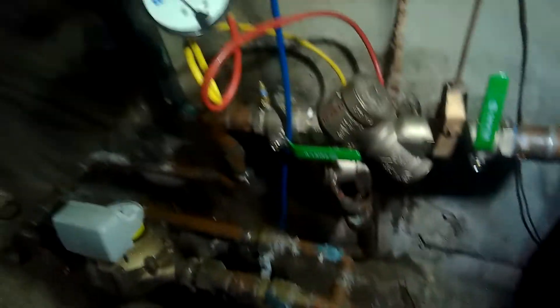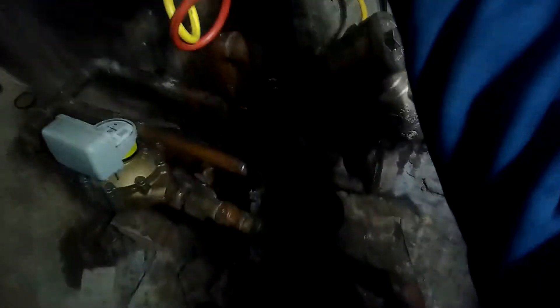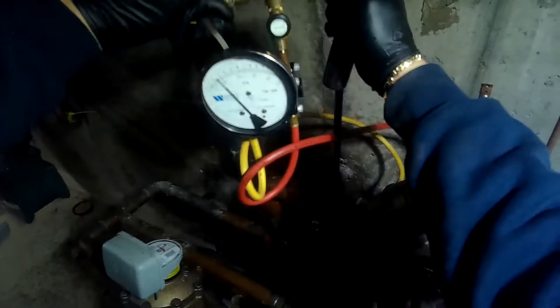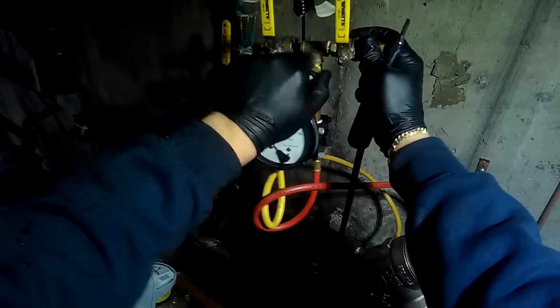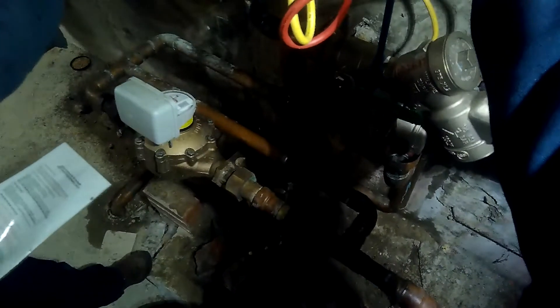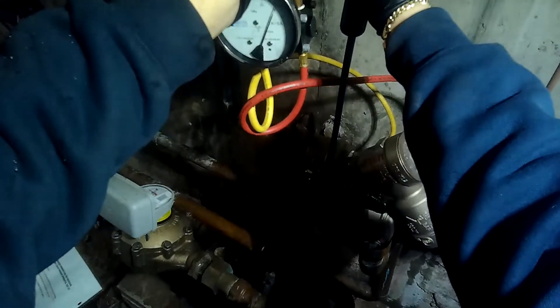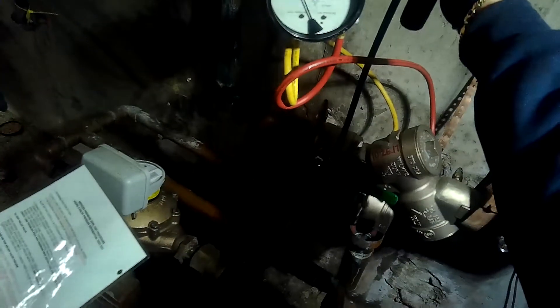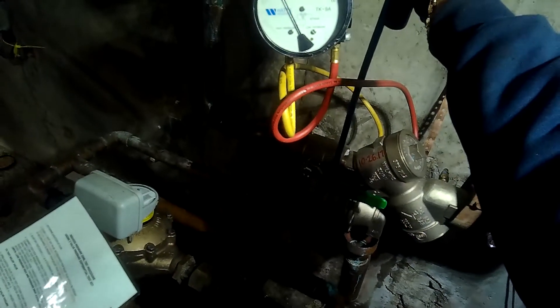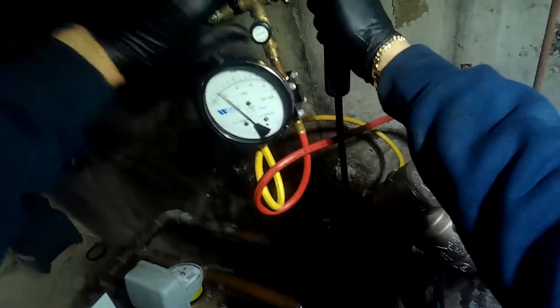Make sure there's no discharge present on the relief valve - there is not. We're going to bleed water through A and C first, like such, and then bleed water through B and C, like such. We make note of our PSIG which is right around three.